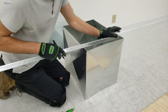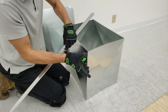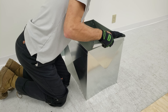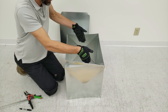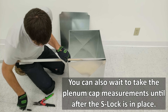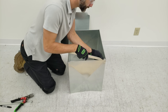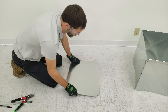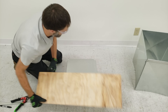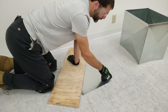I already put this piece of s-lock in and this piece of s-lock in. Basically you're going to set it along these edges, put a mark, and that's where you cut. Inspect it and check that the end cap is going to come into the fold that's inside of the plenum. Next we're going to cross break this end cap so the sheet metal doesn't pop when air pressure comes into the plenum — you come into each section one inch in from both sides.